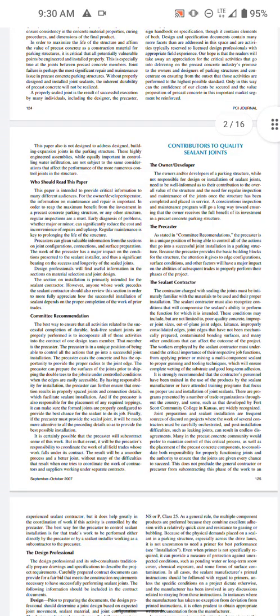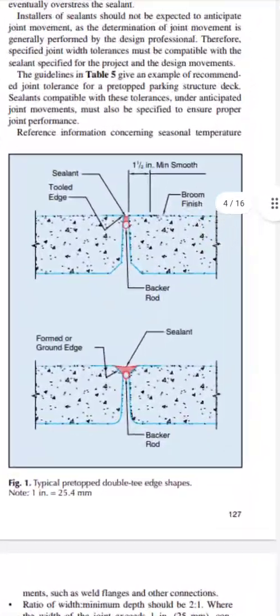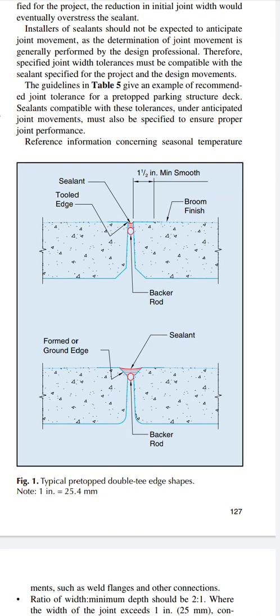For you guys, think about bridges. Expansion joints are full cuts through — they go fully through. Even if you put tile on the deck, you can put tile over an expansion joint, but there was none here. We saw the construction joint, which did not act like an expansion joint. It was a construction joint to bring the two pieces together, but it was not designed for expansion and contraction because it had rebar in it — there was rebar at the underside of it.